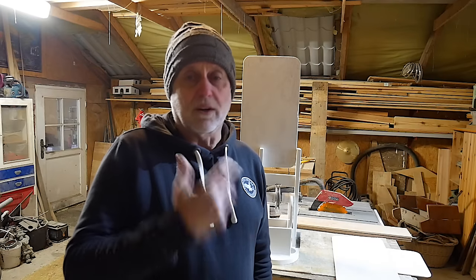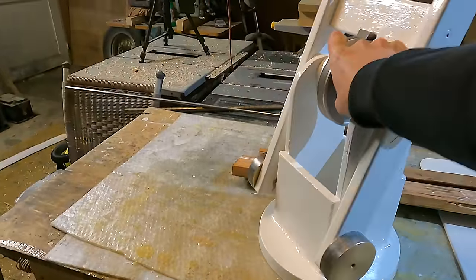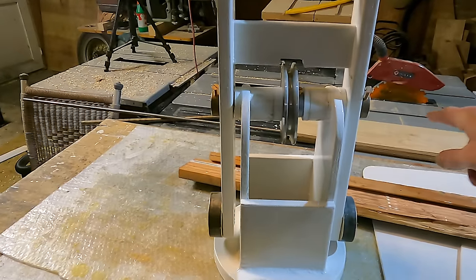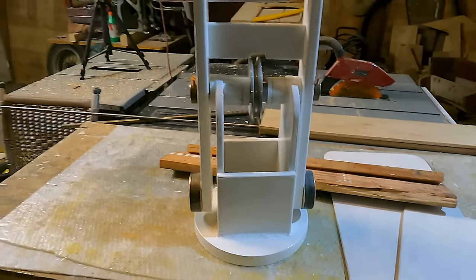This is very, very simple — the vane that you see behind me here just blows in the wind. You set it so it's facing into the wind, and if the boat wanders off course it blows one way or the other, and lines from that go to the trim tab. That turns the trim tab, and the water flow over the trim tab then pushes the main rudder one side or the other — and that's what steers the boat. Of course, when you come to build it, you're going to adapt it a bit to suit the tools, equipment, and materials that you've got available, and I've very much done that. There's a plywood base that will be fitted to the boat and will be able to rotate so you can face the vane into the wind. The base is basically just a holder for the shaft that runs through here. I've used a bronze shaft through there, and lines come off this pulley, go down through the middle of the tower unit, and off to the top of the trim tab.